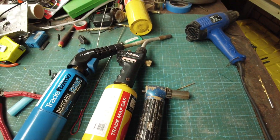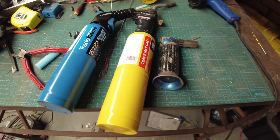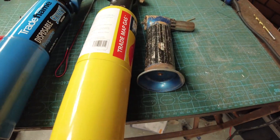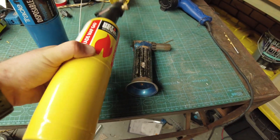If you have it too hot you're gonna wreck it. Not hot enough, you're gonna struggle to even get the rod to melt. But if someone says that gas is too hot or that gas is too cold, it's probably not true. Have a look at the range that it lives in and you'll probably be right.